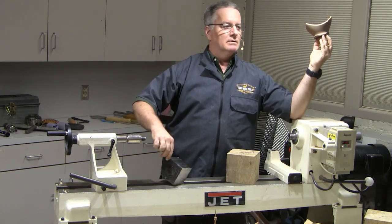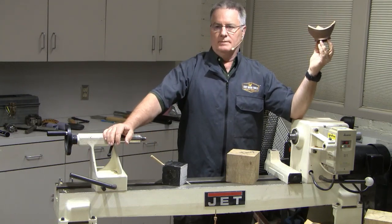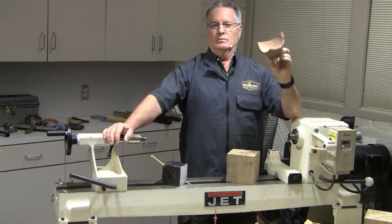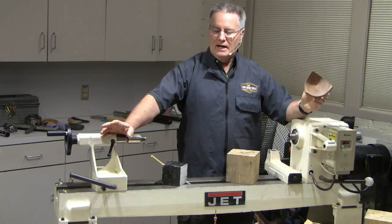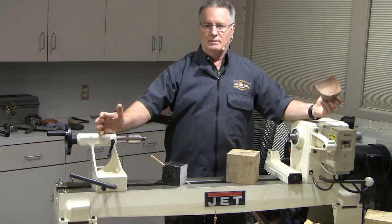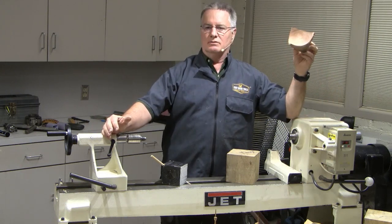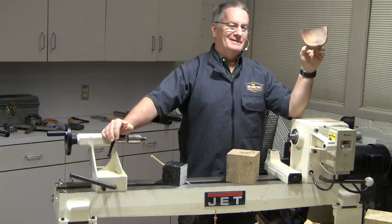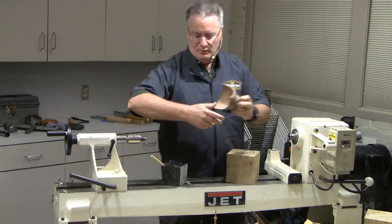This is like cutting a burl. You're going to be cutting side grain, end grain. You're going to be cutting all over the place, okay? This is one of the problems when you start cutting a hardwood and you start trying to get these dimensions, the wings down fairly small. I like to use fairly green woods. I don't really measure the moisture content to see what they are, but this is not a regular shaped bowl, so if it's going to dry and distort, you're really not going to see much distortion in this, even if you're using a fairly wet wood.